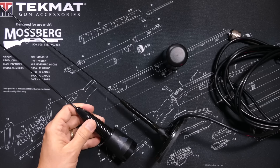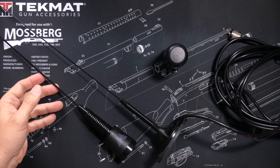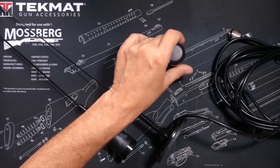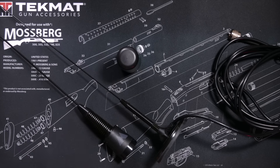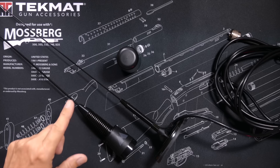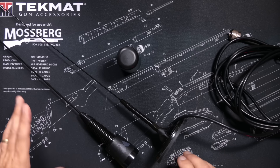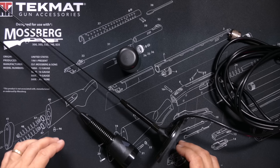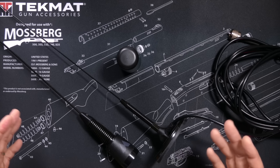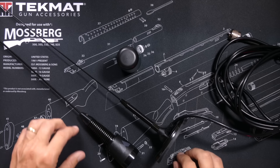Affiliate link below. All three of these antennas are GMRS antennas, so they are pre-tuned for GMRS, meaning you can use them right out of the box with no tuning or cutting required. If you were to analyze all three on a fancy antenna analyzer — which I have done — you would find that the Nagoya and the Midland antenna are both fairly well tuned for the middle of the GMRS frequency spectrum, with both exhibiting their best performance somewhere between the 462 and 467 megahertz range.